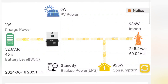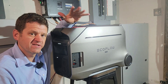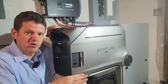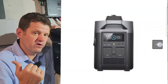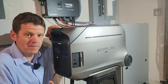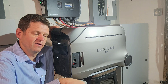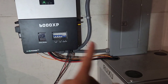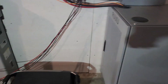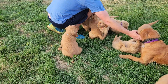Right now my entire house is using 925 watts, so the EcoFlow should run my entire house no problem. What about when the power goes out and the sun isn't out due to a big storm? That's where EcoFlow really stands out. If the battery is dead and there's no solar, they have what's called the Dual Fuel Smart Generator, which runs on propane or gasoline. You plug it into the battery port in the back and if the battery gets low the generator automatically kicks on and starts charging. In Utah I could run about nine days on solar, then use gas on cloudy days. My existing system is more designed for everyday use and long-term outages since it's permanently connected, whereas the EcoFlow is really designed for temporary emergency power outages and is nice because it's a mobile power unit.